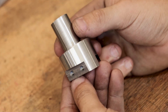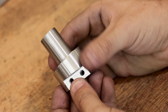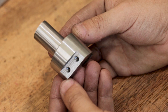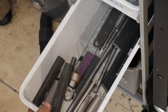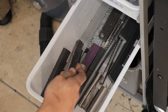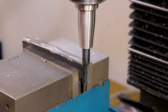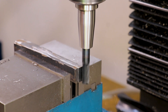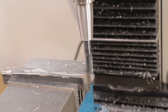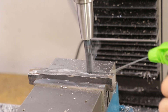And that is the fly cutter body done. Overall the mill and the lathe seemed to handle 4140 really well and the body came out really nicely. Next I'll start to make the tool holder, which I'll make from an offcut of steel. Now the last time I did this I made it from a piece of chrome vanadium tool steel and then heat treated it to prevent wear. In retrospect that was totally overkill for the application, so here I'm just going to leave it as is.